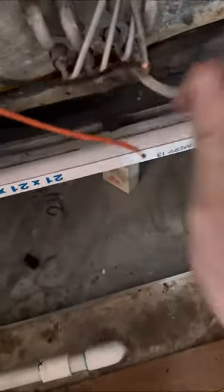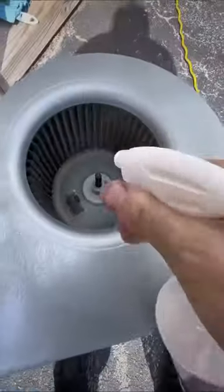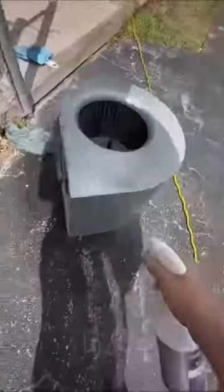The ductwork was starting to get pretty moldy and spotty. So I'm going to recommend either a whole house air purifier or a UV for each individual unit. Now you can see all the gunk starting to build up on the wires and the cabinets and the units themselves. These things were dirty and dusty. And mold grows really fast, especially if the environment is cold, dark, musty, and there's a lot of dust. It's going to be feeding whatever's growing inside the ductwork consistently and constantly. As it's a big house and it needs a lot of air conditioning, the air is continuously being recirculated, and so are the spores.